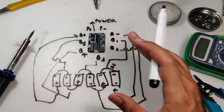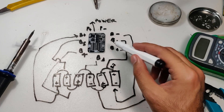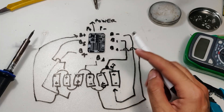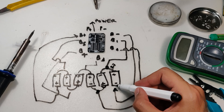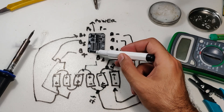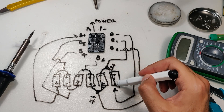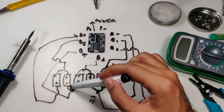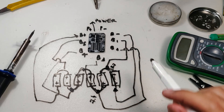If you're wondering about the potential markings — measuring between B1 and ground gives 3.7 volts for one battery. B2 and ground gives 7.4 volts for two batteries. B3 marked 11.1 gives three batteries' potential. B4, marked 14.8, measures the voltage of four batteries, and so on. This is how the connections are supposed to be made.